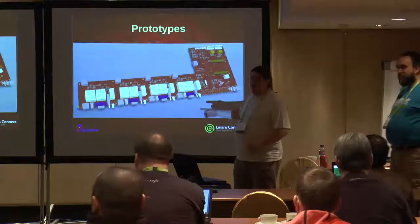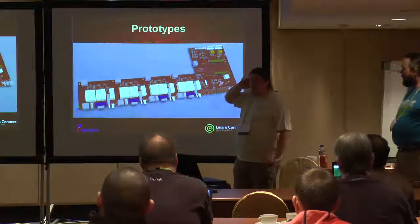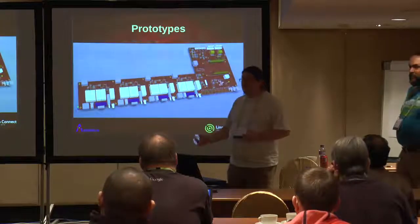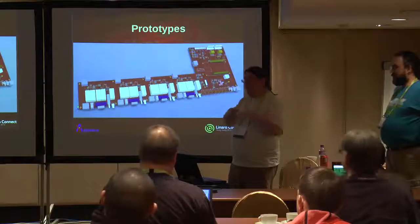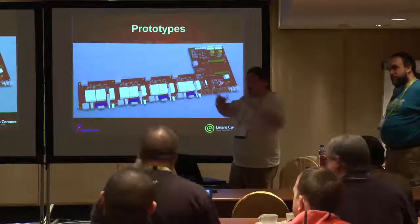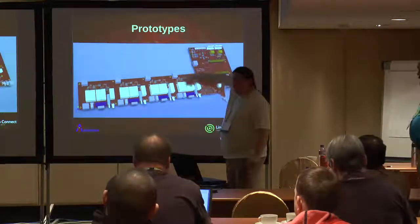And do you have relay on Ethernet as well? So there is no relay on Ethernet, because the Ethernet by default is isolated. It's inductively coupled, magnetically coupled, it is not DC coupled. It is standard to provide power through Ethernet here. This is not a PoE device, I'm just passing Ethernet through.